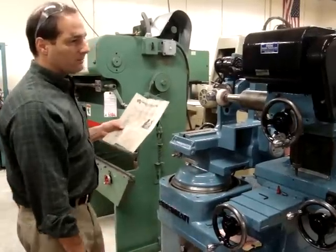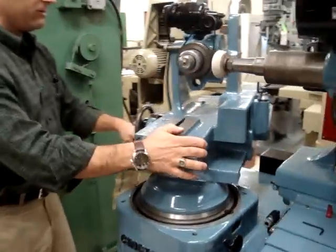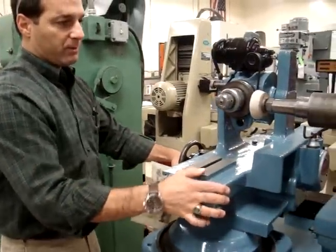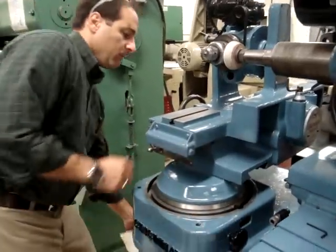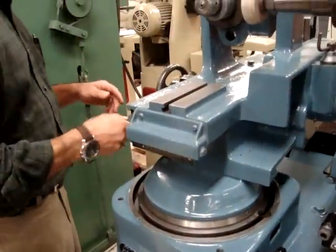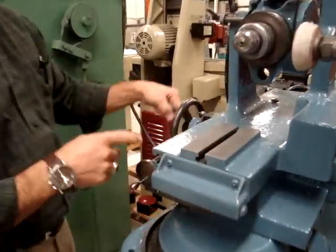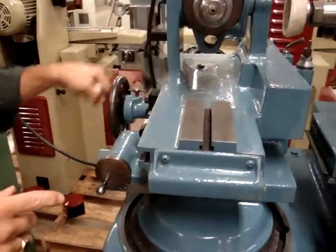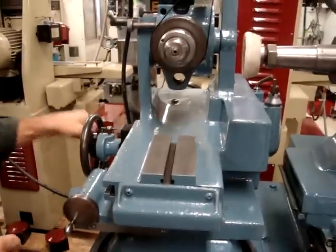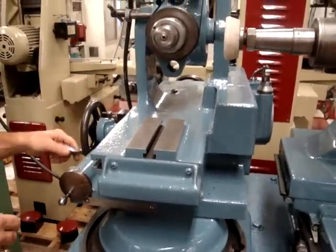We've got it under power and everything runs well. We know that we can crank this knob and this will swing around nice so you can get your different position for when you're grinding. Lock it in place. We know that you can adjust this table left and right if you're facing it, and this will turn it back and forth. This knob here on this side will make it go in and out so you can set where you're grinding your second axis from. There are micrometer stops on this one too so you can bring it in and tighten it up nice.